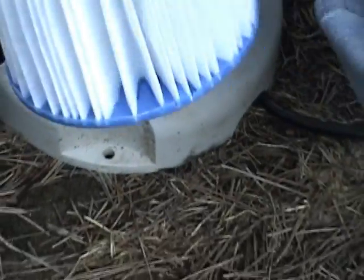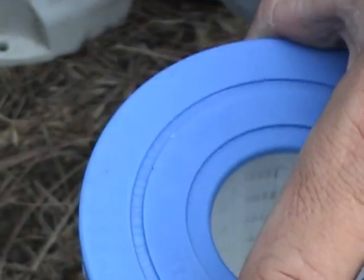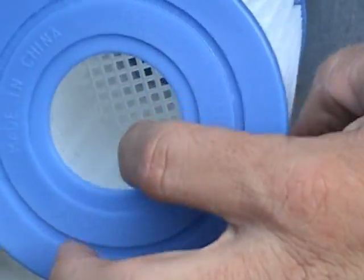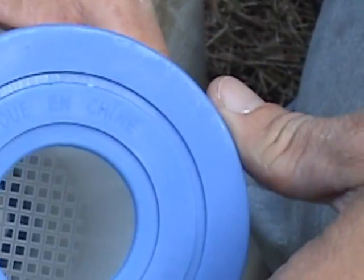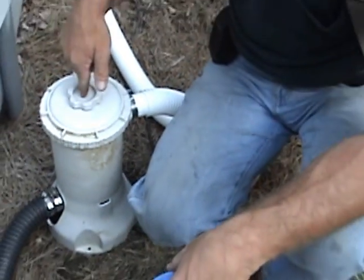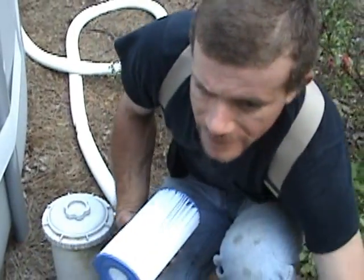While we're sitting here by the pump — in order to keep any crud out of the hose, she wanted to put chlorine in it so it would continuously run through the hose. What she did is just take an old filter and cut the filter media — the paper media — away from it, and take the plastic interior that keeps it from sucking down and crushing when water's been drawn through it. She just cut it out, took that plastic, stuck it down in there, and put a chloro tab in it. So she's got constantly a good strong source of chlorine in the pipe to clean it up.